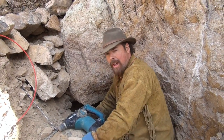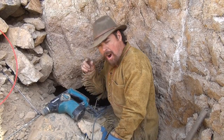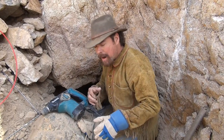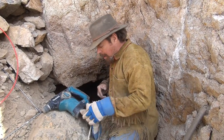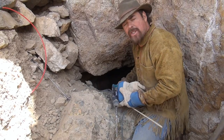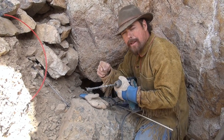The first thing you need to do is determine the type of rock you're drilling in. The harder the better — you've got a lot of igneous rocks that are really hard and they fracture great with a lot of compression. This is limestone, remember it's 3.5 to 4 on Mohs hardness scale, so I know it's going to fracture real easy and I don't need a lot of blasting. First thing: drill your holes — start with the smallest bit you've got, then work up to the biggest.